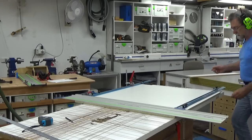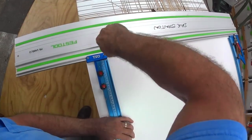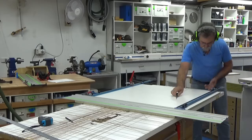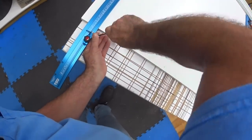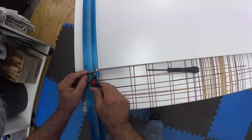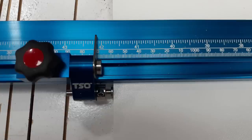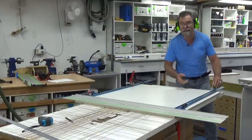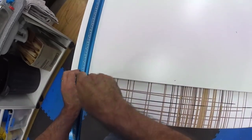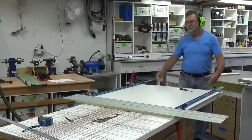I can do it over this side or over there — it doesn't really matter as long as I tighten that up. Back these off, drop that up, bring this along until it's 1070 — until I just can't see the line. You can do it imperial as well. Drop this down, push the stop up, lock it, lift the stop up again, and lock the collar. It can't be easier.